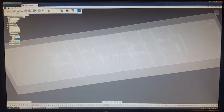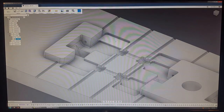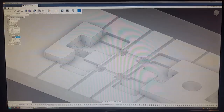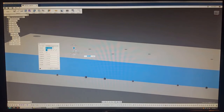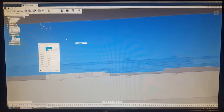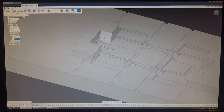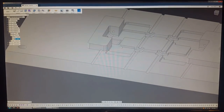So what I ended up doing to solve that is, on the mold here, I had to create these pockets and these extrusions that come up, and these shapes interlock with each other. Let me show you here. As the mold closes, those shapes had to interlock with each other like that. And for that hole that has an extra undercut, I actually drilled a hole through this part. After this whole thing was machined, I put the halves together and used a drill bit to drill through here.